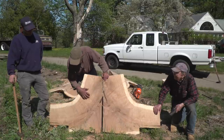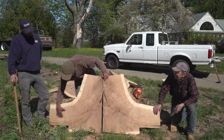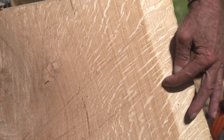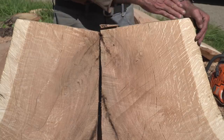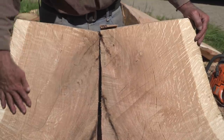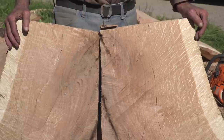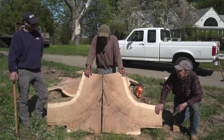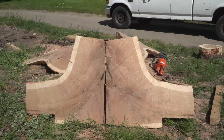I don't think a lot of people know this stuff is in these oak trees - it's from the trunk to the branch. You really can't tell the difference between the grain at all - it's just beautiful. Look at these medullary rays right here in the oak, 90 degrees to the annual rings. They're showing up a lot right in there because I've cut it quite parallel to them in both spots right here - that's why they show up so much. The medullary rays to me are one of the most beautiful things in wood that I have ever seen. I really want to thank Will for allowing us to be out here cutting it up, and thank Reed for helping me so much. We're going to take them back to the shop and dress them up and just see what we can do with them.